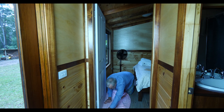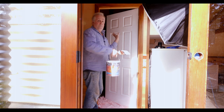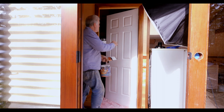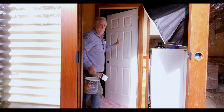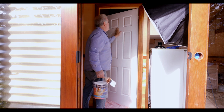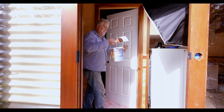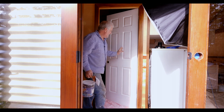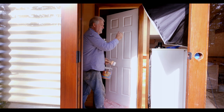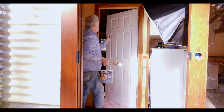Adjust your drop cloth — I've got a sheet here. Normally this door would be all the way open where it hits the back of the wall; it just makes it a lot easier to paint. I've got it fixed there so it can't move, but so you guys can actually see what's going to happen. I've given it a really light rub with 180 sandpaper so it's nice and smooth. We're not trying to create a key here — this is going to grip onto the first coat regardless. You're simply just making it as smooth as possible. Our main goal is to get a really super smooth and professional finish.